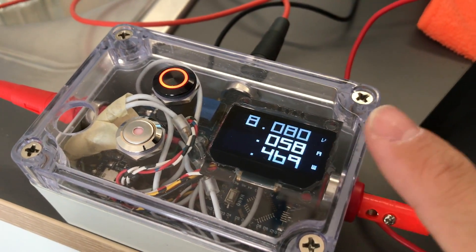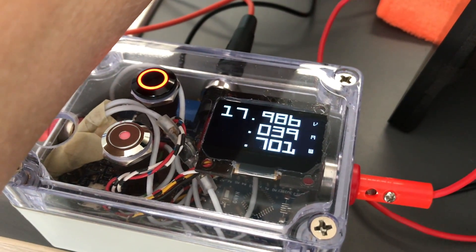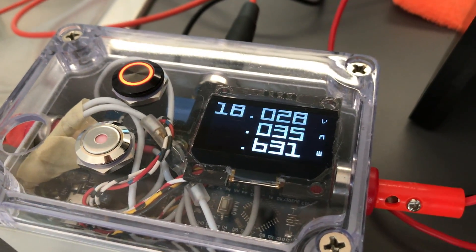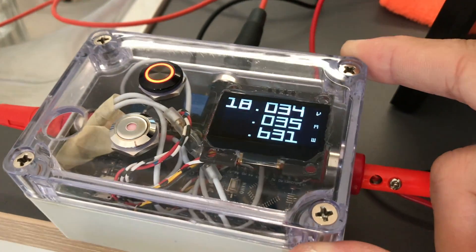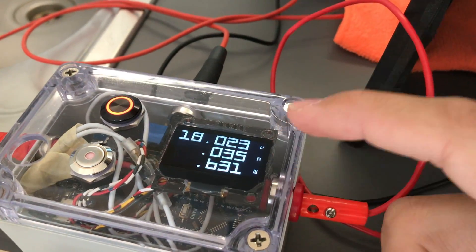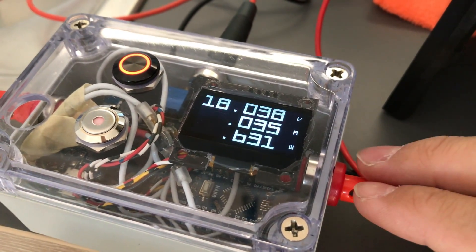This is not too bad for a battery-powered solution. You'd probably want to go higher on the voltage — up to 18 volts or even more. In any case, at idle it draws about half a watt given the switch-mode converters inside. Battery-wise it's definitely doable: just shove 8 volts in and you're done, though you'd probably want an external switch of some kind.